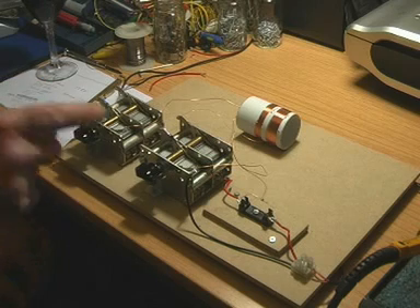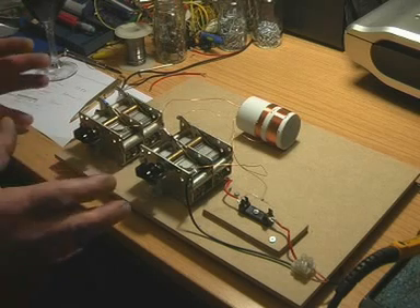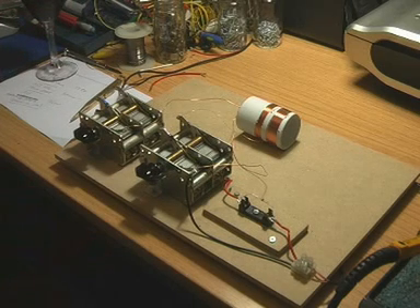Here we have our new and final coil. Here's the original winding of about 60 turns, and near to it is a winding made of thicker wire, about 10 or 11 turns. The aerial is connected to this and goes to earth, and it is coupled into our tuning coil. Will this ever-increasingly sophisticated circuit enable us to finally separate out the three stations? Let's turn up the volume and see. How curious — there's no sound.